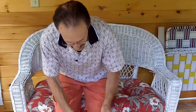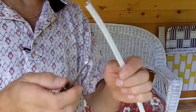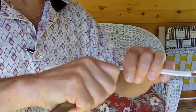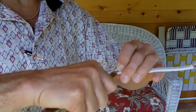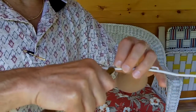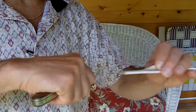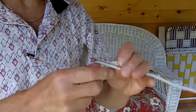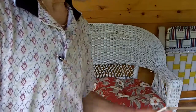What I have here is a piece of Romex wire. I'm going to strip the jacket off of it to show you that, and then strip the insulation off the copper conductor and show you how we attach that. I have a hook-blade knife — it's an electrician's knife made to hook under the jacket of the cable, the Romex cable. I would encourage someone who's not well practiced at this to use gloves. Safety first — we don't want to slice ourselves up or spend Saturday afternoon at the hospital getting stitches. So you take that jacket off and strip it off like that.